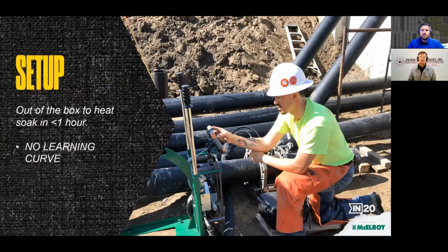And we took a few moments to marvel at the machine, for its design and with some skepticism. It's very small and lightweight, and my concern was that it wouldn't be strong enough to hold up to HDPE, or that because it's so small and light that it might have some flex in the carriage, which wasn't true. It turned out it's very rigid, and although small, it's very strong and robust, and had plenty of strength and pressure to fuse this 8-inch DR11 that we were working with. So that wasn't an issue at all.